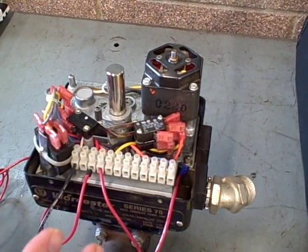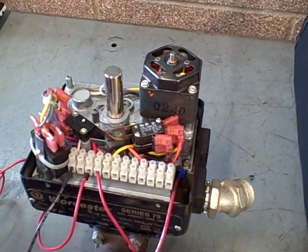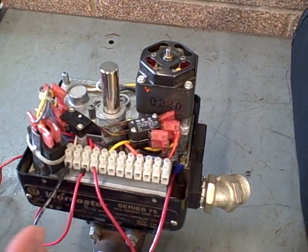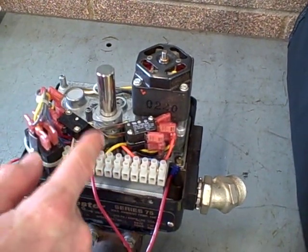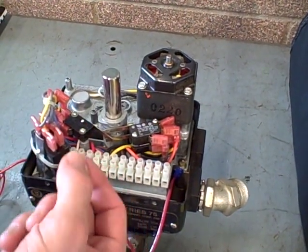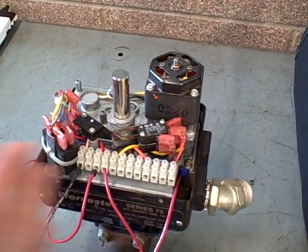With larger MOVs you're not going to find cam arrangements that are quite this crude. You'll find much more sophisticated styles of limit switches, but they all work on basically the same principle — the limit switch somehow monitors mechanically the position of the valve and then will open or close a contact to stop that valve's motion before it gets too far.